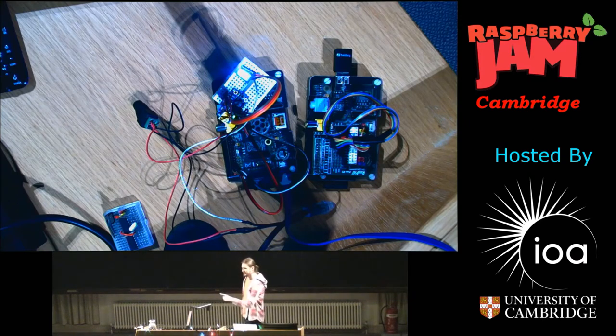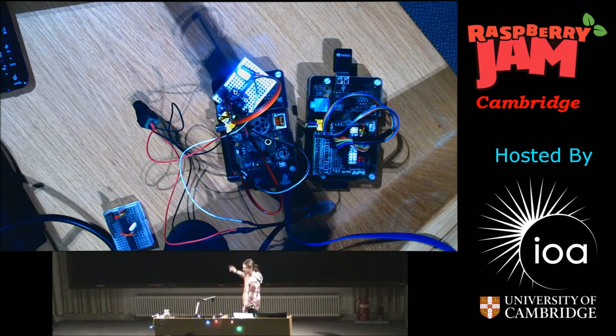You can also do proper PWM — pulse width modulation — basically turning a pin on or off at very high speed at a very specific frequency, which is useful for certain applications. The other reason for picking up an Arduino is because this model of having a brain like the Raspberry Pi at the hub of your construction, with Arduinos and other microprocessors doing small discrete tasks well and specifically, is quite a common model found in machines today.